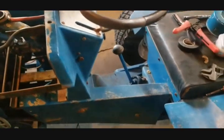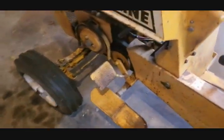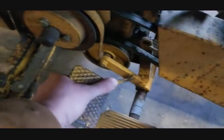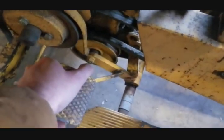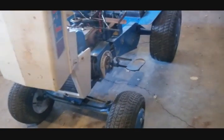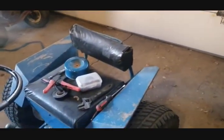Normally on these tractors you notice way more travel and the belt fully loosens up. My belt's not fully loosening — it's enough to stop the tractor but not good enough. Someone installed that bolt on backwards. I also have a new seat coming for it.